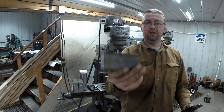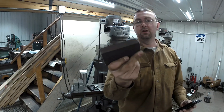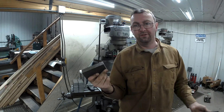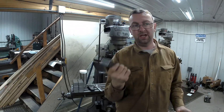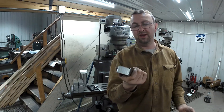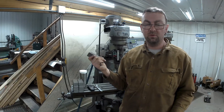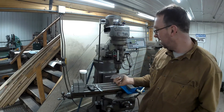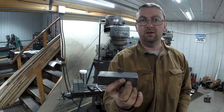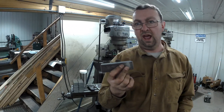Our pieces are all cut. They're four and a half inches long, 4140 annealed, inch and a quarter by two. It's overkill obviously - I don't need anything this wide or this heavy - but this will work to my advantage because it is so heavy. This will also double as being usable on my horizontal boring mill. I've got ten of them cut, and what we need to do first is mill a step in the back side where they'll drop into the T-slot.